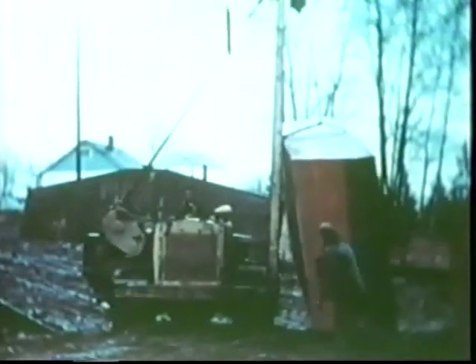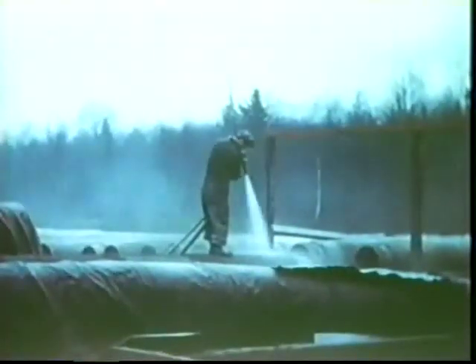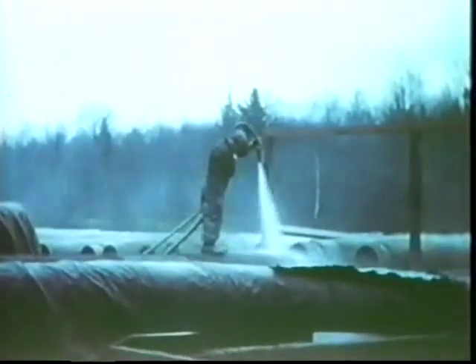In the Vancouver area, where the weather was mild but moist, preparations were made by Missouri Valley Canadian Limited for the greatest of all the 98 stream and river crossings on the project. The pipe sections, two feet in diameter and a half inch thick, which had previously been triple coated and triple wrapped for corrosion protection, were now sprayed with a concrete mixture over reinforcing mesh. The pipe was next welded together in two long strings, so that the bulk of the line could be pulled right across the river.